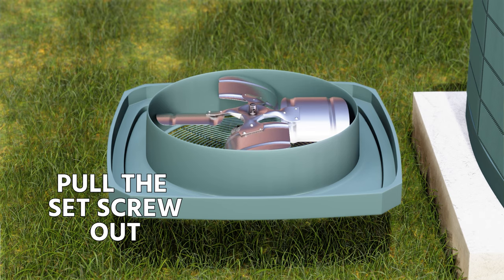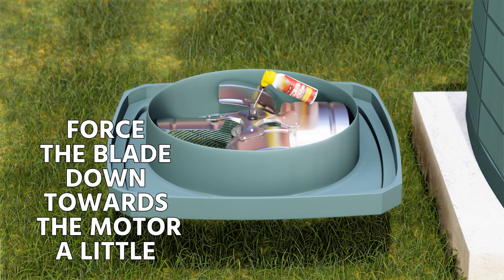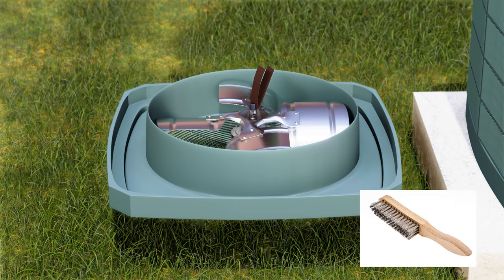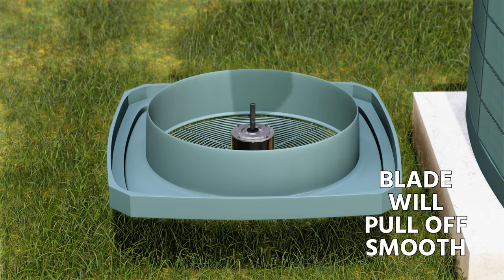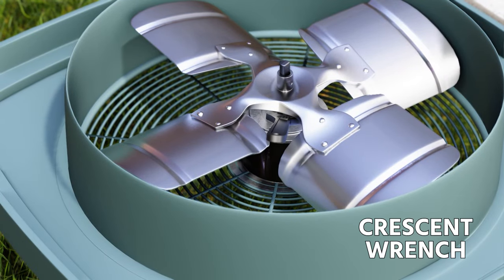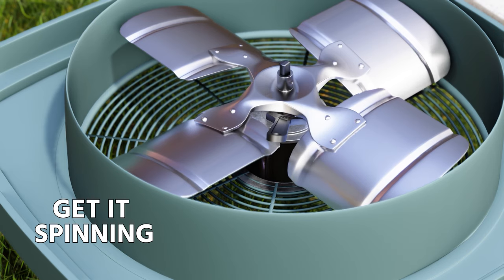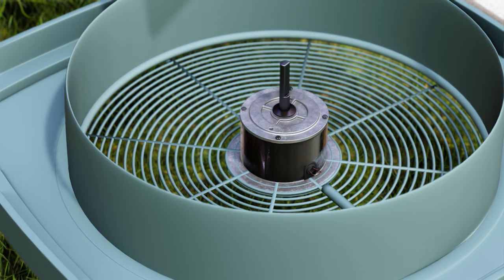If you're going to reuse the old blade, pull the set screw all the way out, use some penetrating lubricant and spray it down really well, then force the blade down toward the motor just a little bit to expose more of the end shaft. Clean it up well with sandcloth, wire brushes, or emery cloth so the blade will pull off smoothly. Sometimes it helps to put an adjustable wrench on the backside against the flat to hold it, then turn the blade by hand with opposing forces to break it free, then pull it up and away from the motor.